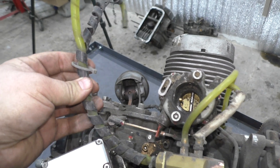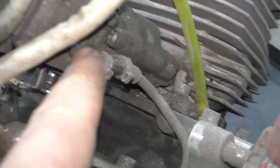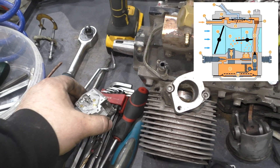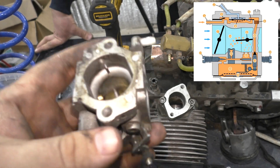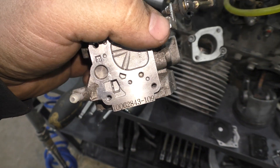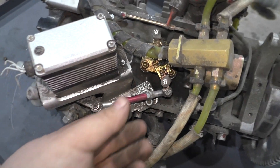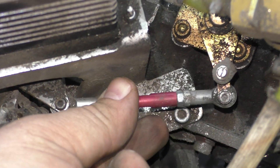The fuel system is designed with four individual carburetors. The yellow tube is the fuel supply, while the iron tube connects to the blow-by chamber in the crankcase. Another channel is also connected to the atmosphere. In terms of design, the carburetors resemble those from a chainsaw, only larger in size — two diaphragms, one serving as the fuel pump and the other as the fuel metering device. All four carburetors are controlled by a single servomotor, which controls all throttle valves at once.